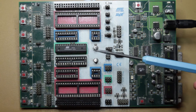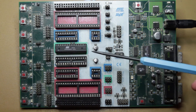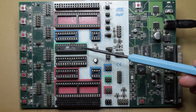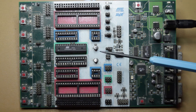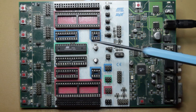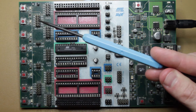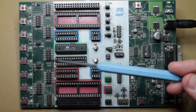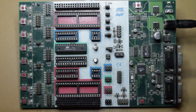So the first question is, well why do we need a development kit? A development kit gives you an environment that lets you test the particular chip you want, without a whole lot more extra work to do. So it has a socket for an oscillator, it's got some LEDs for testing, it's got some switches for testing, it breaks out all of the ports nicely, and it's got a whole bunch of stuff that lets you load code onto the chip.